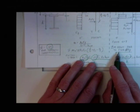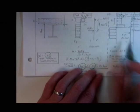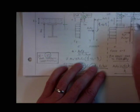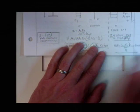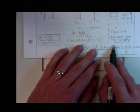That's the point where the loads balance, right? Find the points where the loads balance. And then you have to sum everything above and sum everything below. Well, not sum, you have to sum the moments. Multiply by the moment arm, the distance to the plastic neutral axis, for each one of these. Basically, sum the moments about the plastic neutral axis. Find its capacity. Just like you did on your homework. Or are going to do on your homework. Okay?